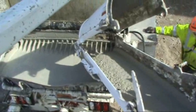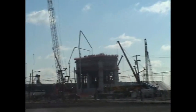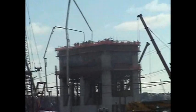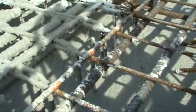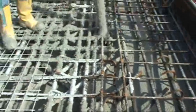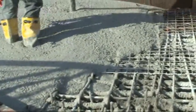Concrete was delivered to the site at a production rate of 175 cubic yards per hour. Including the boom height, the concrete was pumped as high as 140 feet. The 70% slag mix was originally designed for the columns and beams. The results in the mass pours were a maximum temperature of 160 degrees Fahrenheit, with strengths reaching over 3,000 psi in 3 days. As in most SCC applications, the forms were designed to handle liquid head, and when stripped, produced a mirrored finish without the use of any internal or external vibration.